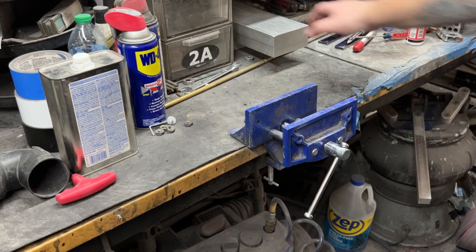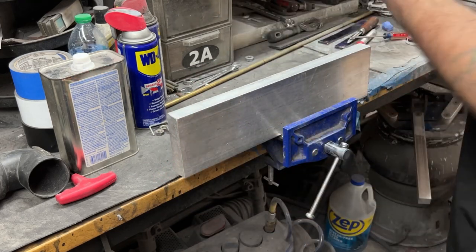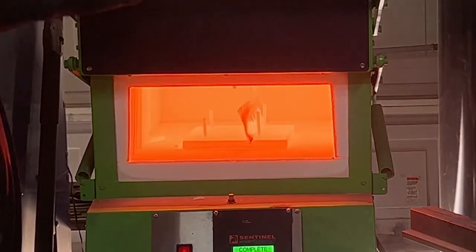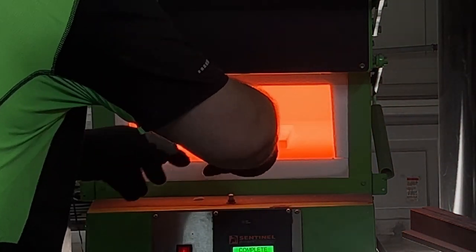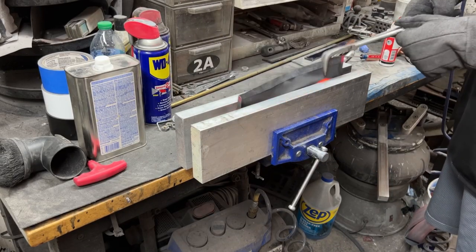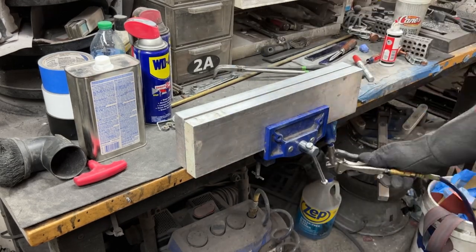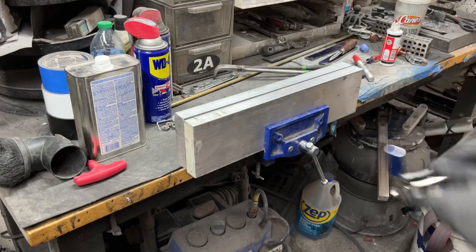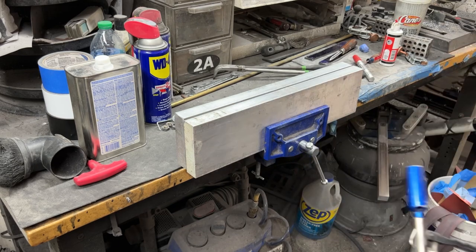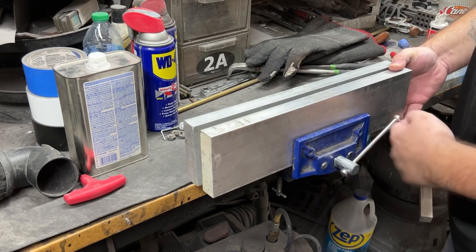And here we go, it's time to start the quenching process. I'm using aluminum plates vertically because if you lay an aluminum plate down like most makers do, then lay a blade on top of it, then go get your top plate and put it on, it's actually soaking heat out of the bottom before you get to that top one, and it can actually start warping your steel. This way, you're compressing both sides together at the same time, and you're drawing the heat out evenly, so it's much less likely to ever warp. Then you use the compressed air to force it to cool even faster, and then you're well on your way to being able to get it out of the bag and start playing with your knife, getting it into temper and starting to do the hard work.